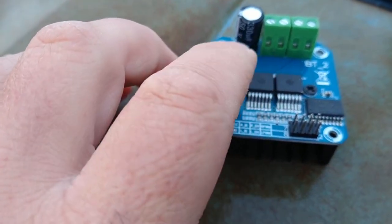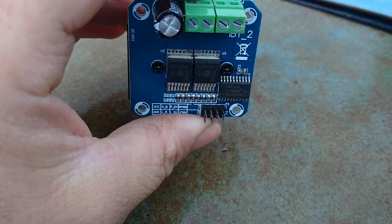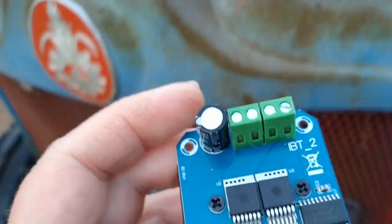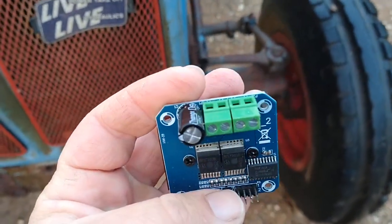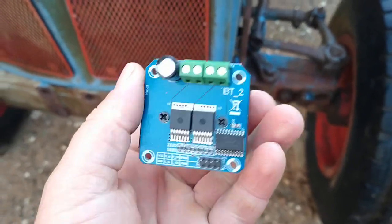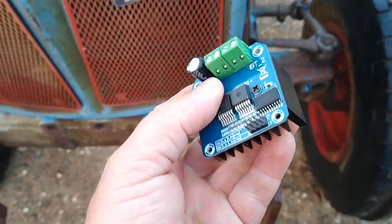If you use a variable resistor, you basically cut the voltage back and you lose torque. With these PWM controllers, I'm pretty sure you maintain your maximum torque even through all RPM ranges. Someone who knows more about it than I do might have a comment on that. Anyway, these are some of the controls that are around. Like that first one I pointed out with a potentiometer — something along those lines might be more suitable for what you're trying to do. But just connecting the wire and running it with a little DC motor will probably do too. Just depends how flash you want to be.